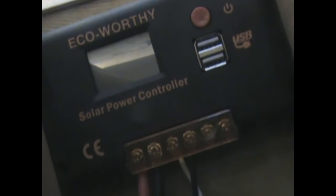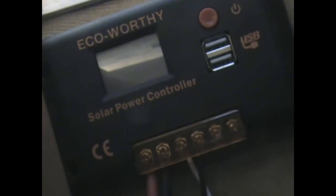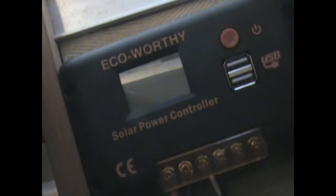I am probably going to upgrade this to a better one. I know I have to upgrade these wires because this is only 16-gauge and it should be at least 10-gauge. But for the time being it works — it charged our batteries during the day and gave us enough juice to go through the evening. We were running three batteries, especially since I got cold that one night.